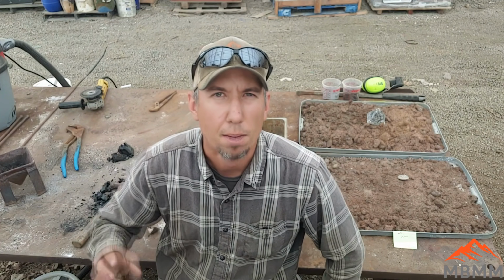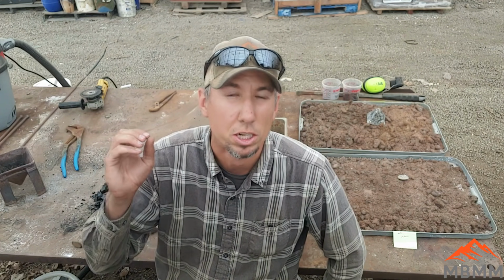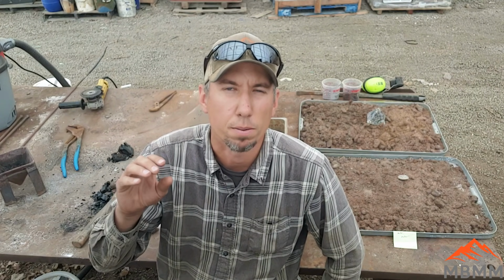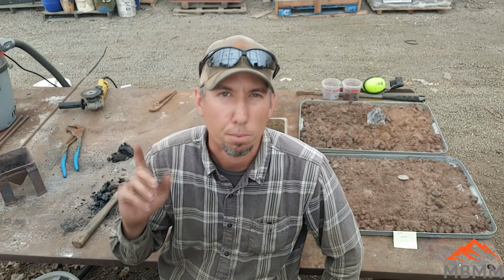There's definitely still some kinks to work out, but being able to essentially dissolve or get rid of all that iron, that stainless steel, and being able to get a nice fluid pour and a nice melt in our propane furnace at about 2,000 degrees Fahrenheit is super exciting for me. So now we actually have a path forward to take these two trays of metal here behind us from our PCBs and pour them into our cone mold, and we're going to actually get real metal blocks.